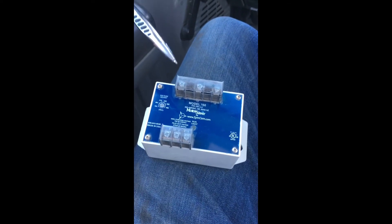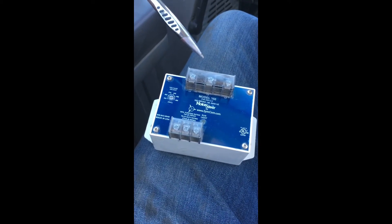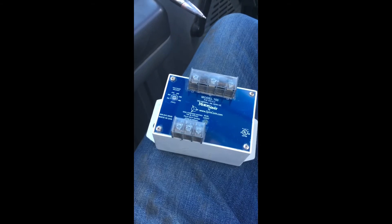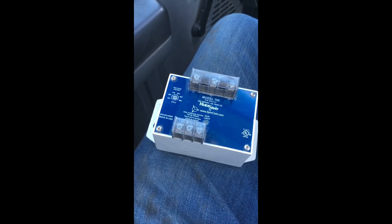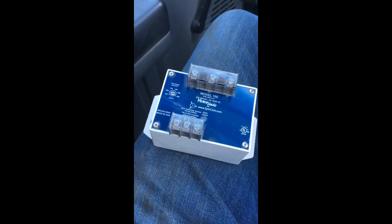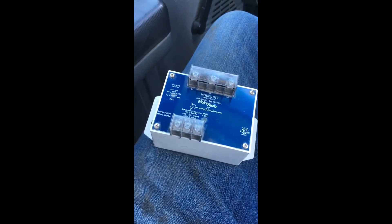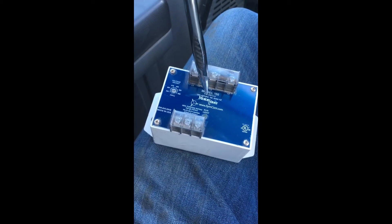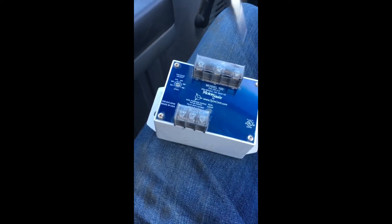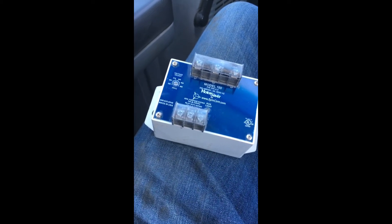The reason for the delay is this: let's say you have a power outage and you have a big deep well pump. What you don't want is the power goes out, then comes back on in about 20 seconds, and your pump just turns on again. The problem is when those big deep wells turn off, they do a thing called a backspin, where all the pressure and water goes back down through the shaft and causes that motor to run in reverse. If that delay is not on there, this thing will close the contact, turn the motor on while it's running backwards, and it'll spin the shaft right off, snap it, and send it down into the hole.